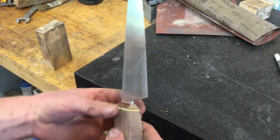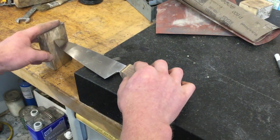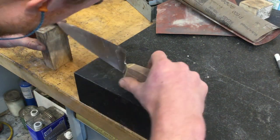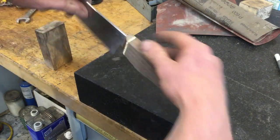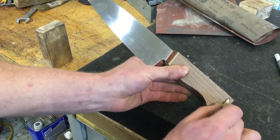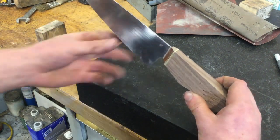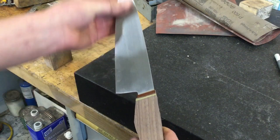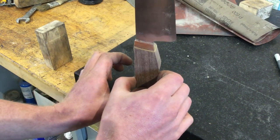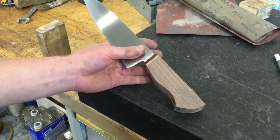And in this case, because we don't want to touch the front of these handle planes, we're going to take whichever side scribes the lower line and grind a little bit away from the back side of it. So I can see that this side of the handle is making a lower line. And as we remove a little bit of material from back here, it will bring that tip up ever so slightly to meet that line. So again, just like it was moving the grind when we were grinding the blade, applying pressure when it's on the platen, applying pressure toward the bottom rather than toward the top should walk that grind back ever so slightly. And again, this is the side we want to take material from.